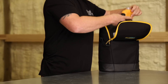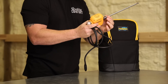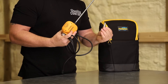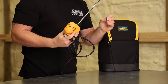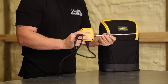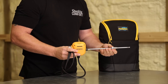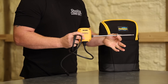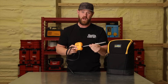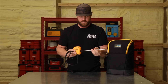The first thing you're going to notice is the actual combustion probe. Just like most probes, it has a cone fitting to where once you drill the hole into the vent ducting, you can basically screw that in there, friction fit it, and then this probe will slide right into there. Depending on how you need to adjust it, you can lock it down with a set screw and it'll hold it in place. The main thing is probe placement — you want to make sure you're getting it in the right orientation and the right depth when putting it into the actual ducting.